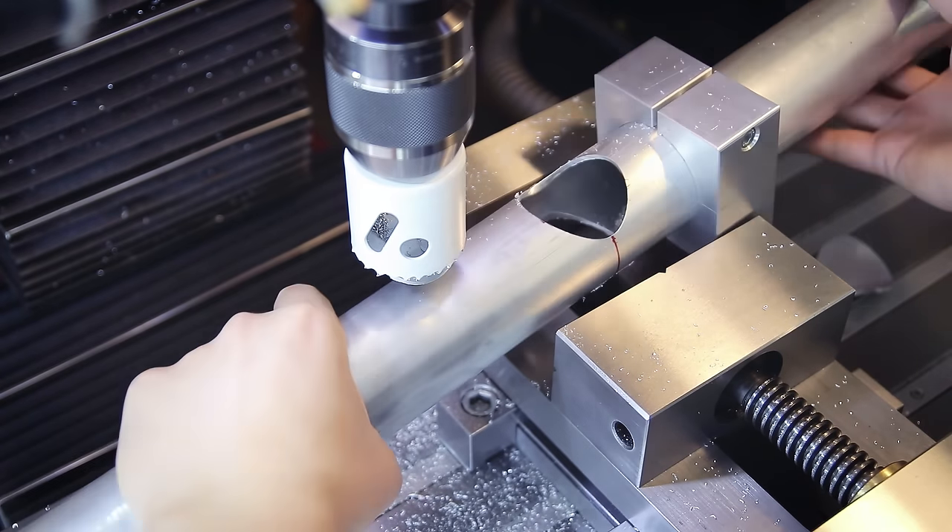With the first side cut, I just need to flip the whole jig around and do the same thing on the other side. Those miters are done now. This whole process took me the better part of a day to set up, with the actual cuts only taking a few minutes — and that's exactly why mass-produced things are cheap and handmade things are very expensive. This is also the main reason I can't build a bike for you and sell it: with the amount of hours I put into a one-off prototype like this, I can guarantee you would not want to pay the amount I'd have to charge even if I worked at minimum wage. The fit with the rest of the frame is looking good, so the next step will be to actually attach the side pieces — but first I put the frame back into the jig to do one last check-up.